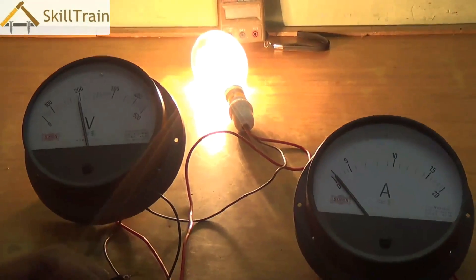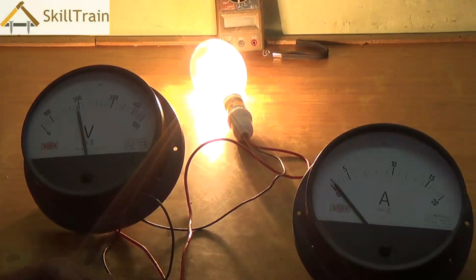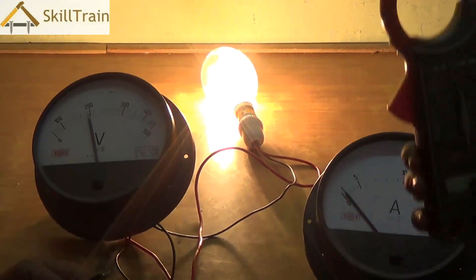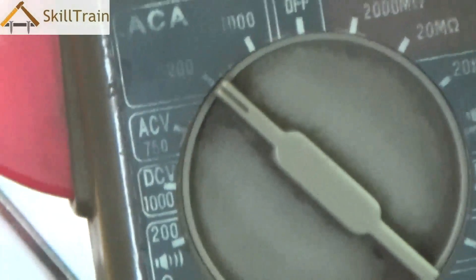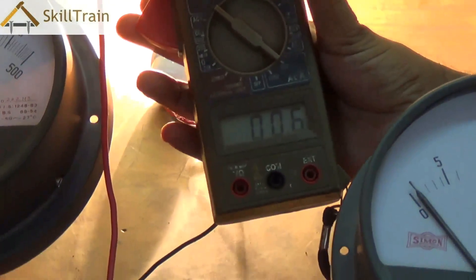The indicator is around the 1 ampere mark but slightly less than one — roughly 0.6 or 0.7 amperes. It's a pretty small load: even a 200 watt bulb takes just about 0.6 amperes, and that's why an analog ammeter may not display it very clearly. For larger equipment that draws more current, the indicator will go up. You can also find this ampere value using a digital clamp meter or tongue tester — place the knob at the 200 ampere position, insert the clamps into the phase or neutral line, and it digitally shows 0.6 amperes.